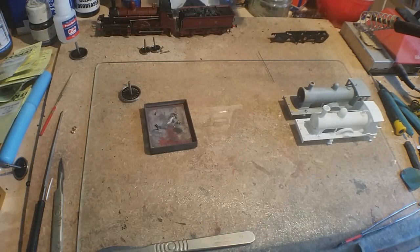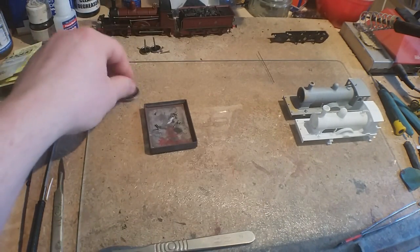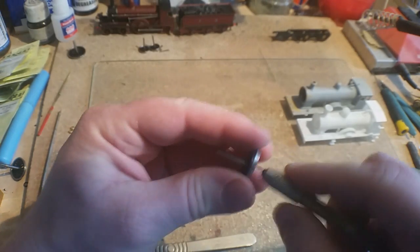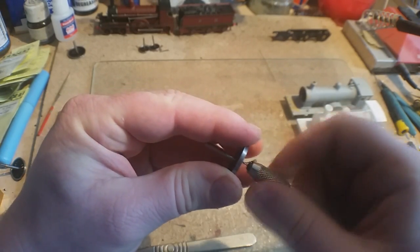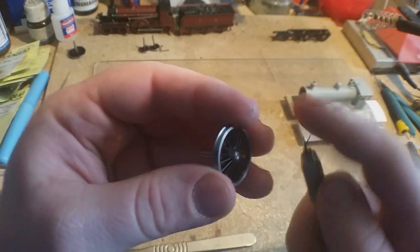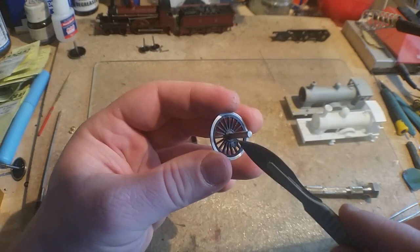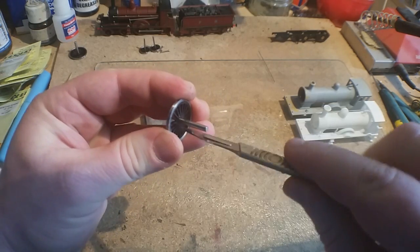Number 61 to 80 — we need a number 70. When you put the top in the drill chuck, just give it a little spin to make sure it's seated squarely — it can be a bit of a pain. There's a dimple on the front so it's not hard to locate; just drill it as straight as you can, don't press too hard. It says to countersink it — if you want to get a proper countersink and do it properly, or just use a bigger drill size. I'll just bodge it with a small one: put the blade in and just twist it a little bit, not too much.